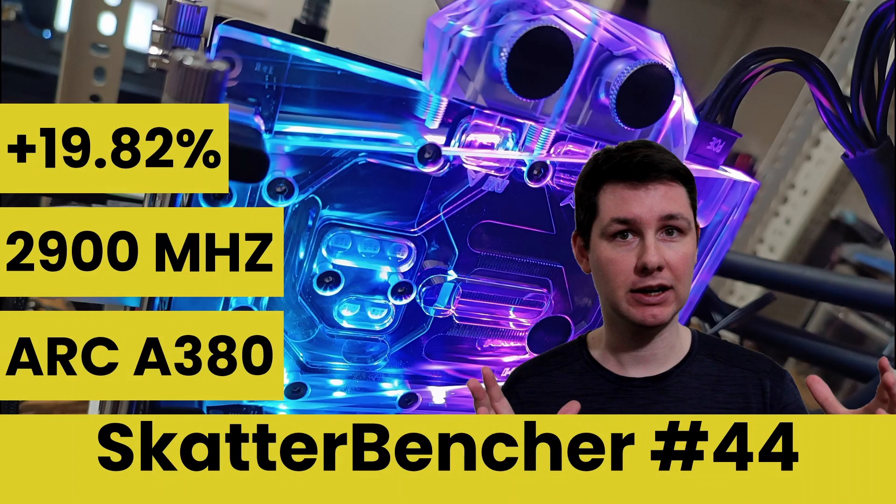Thirdly, I'm interested to see how water-cooled VRMs can help us either cost-optimize motherboard designs or squeeze more performance out of basic or high-performance designs. I know there's a lot more that goes into designing a proper VRM than just worrying about thermal limitations, and better cooling isn't a catch-all solution — but maybe something cool will come out of this. Lastly, VRM temperature has become a recurring theme when it comes to overclocking bottlenecks, as we've seen in the GT 1030 and ARC A380 guides where it becomes the limiting factor for voltage headroom.